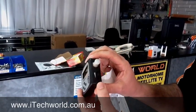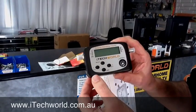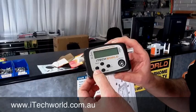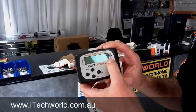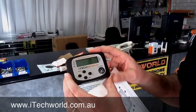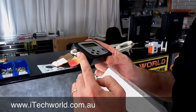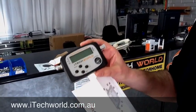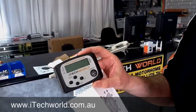On the side there's a little adjustment, and that's for the signal strength. You've also got attenuation buttons. Ideally you want to have the highest attenuation. You get it up to 100, and then you scale it back down to zero. This end here says satellite, so that goes to your satellite dish. It's a standard F-type connector, as you can see — a screw-on to standard satellite cable. And the other side says receiver, which plugs onto the cable that goes to your satellite receiver.